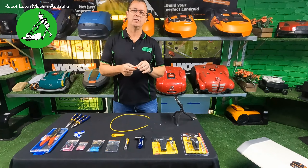There's basically no sealing on these connectors whatsoever - they don't seal from water at all. Moisture gets into the joint, gets inside the wire, and corrodes the inside of the wire out. You'll have nothing but troubles with your boundary wire if you use these joints, so do yourself a favor and throw them in the bin.